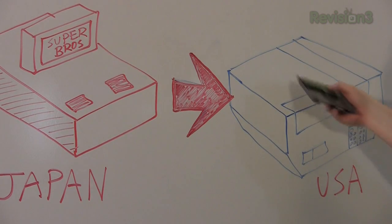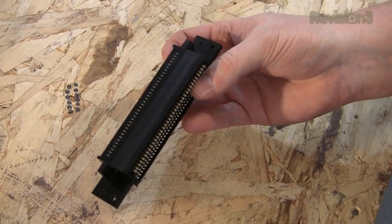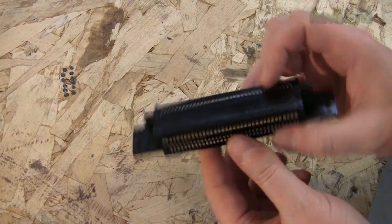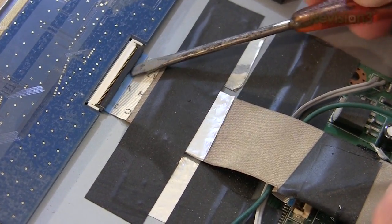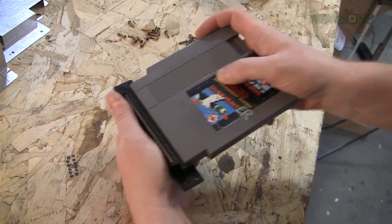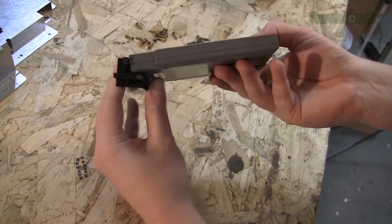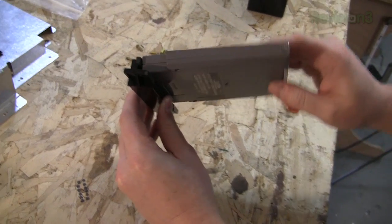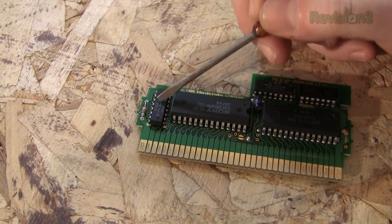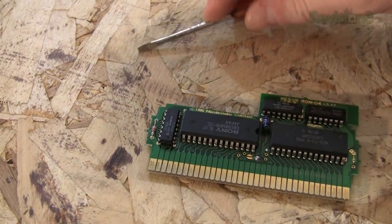The larger cartridge in the slot is mostly for show — the cartridges themselves are mostly empty. The front-loading slot used an elaborate connector called a ZIF, Zero Insertion Force System. This should not be confused with an actual ZIF socket used for flat ribbon cables. Nintendo's slot had a couple of problems: one, inserting the cartridge actually required more than zero force — false advertising. Two, pressing the cartridge down bent the lower pins more than the top ones, eventually wearing them out. And three, Nintendo's lockout chip required a better connection than the game circuitry itself, often causing gray screen and cartridge blowing problems.